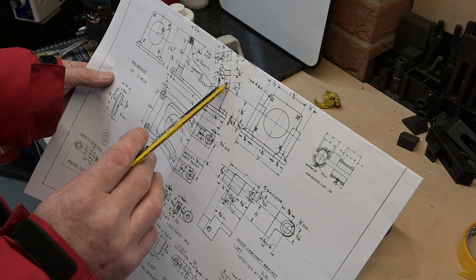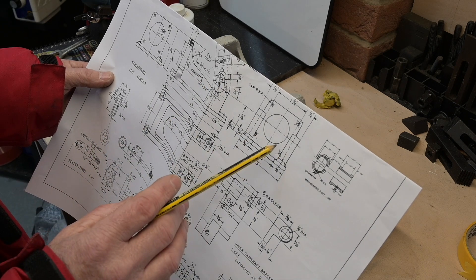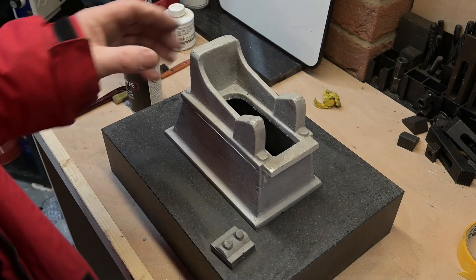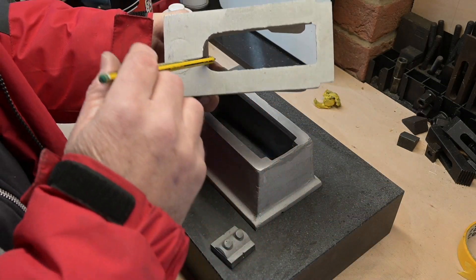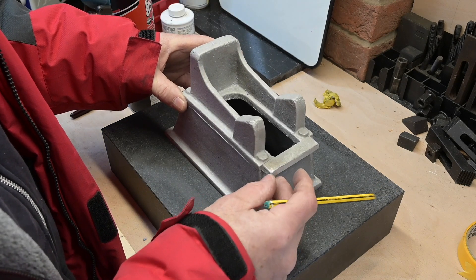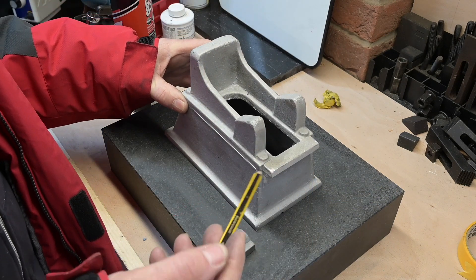The first thing I'm going to do is to machine the base off, and then I'll machine these faces to get those matching, and then I'll just fettle it up a bit. It's a bit rough around here and the castings are not very good, but then they never are, are they, no matter where you get them from.